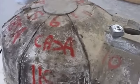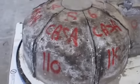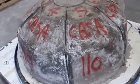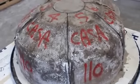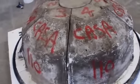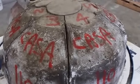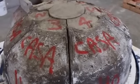If you do have issues with getting all the joints to fit nice and tight, within that 16th to a half inch. If a single joint is slightly larger than a half an inch, this is okay. You can pack the mortar into that joint, but you don't want to go beyond that, all right? If you pack two joints, then thermal expansion and contraction can lead to cracking.